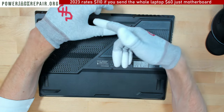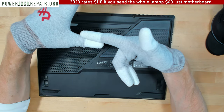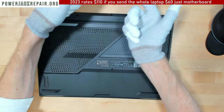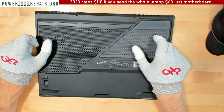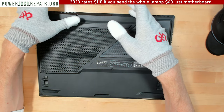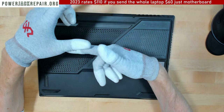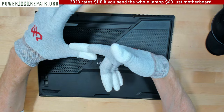Once that starts to oxidize, people start to twist it and turn it to make a sweet spot. Like if you jumpstart a battery from one car to another car, sometimes you have to wiggle those cables to jumpstart it, because there is oxidation everywhere, either on the cables or on the battery itself. So people start to wiggle it, and eventually they break the connector here. But it's all because of that spark.